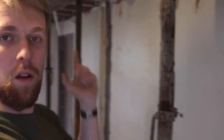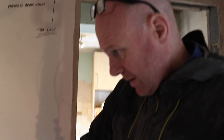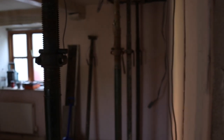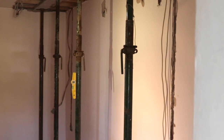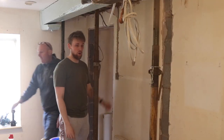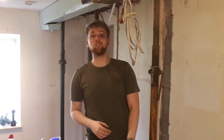The house is fully propped — we've got five acros down the kitchen wall and five down the other wall. All the acros are in; check that for level — bang on. With everything propped, it's now time to smash the wall out, so we're going to mask up and pray the house doesn't collapse. We've followed what everyone said: there are ten acros holding this up with two extra in reserve if we start seeing anything dodgy. Time to knock this wall out, get the wheelbarrow full, and start dumping it in the garden — because I haven't yet organised a skip, like an absolute amateur. Once we get the skip we'll have to move all the rubbish again, so I should have thought ahead. Anyway, let's crash, bang, wallop.